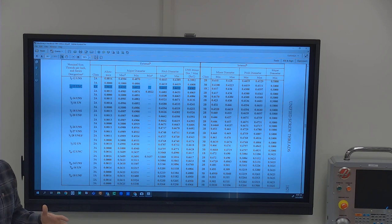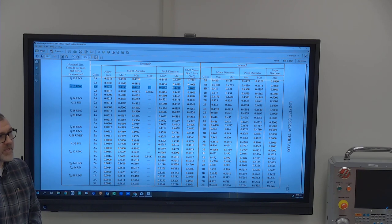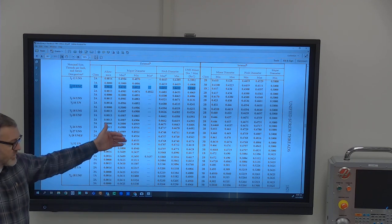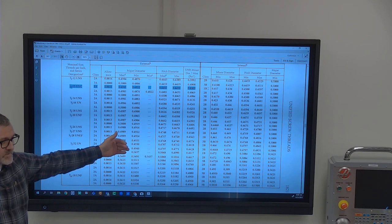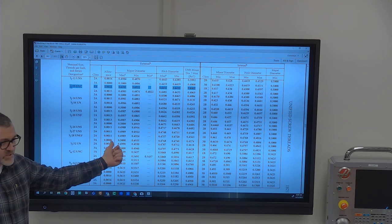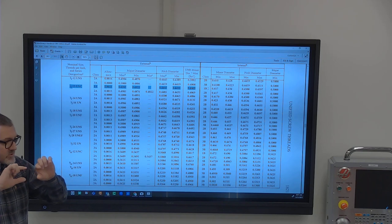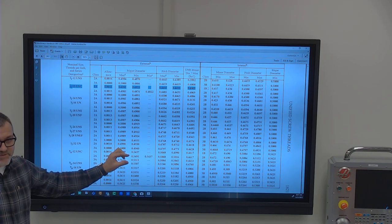We made ejection seat booster tubes to go in jet ejection seats, and we made probably 1,000 of them and never made a good one. They were like this long, 80 thousandths wall tubing, concentricity with like 2/10 of the whole length of it, 2/10 tolerance throughout the entire thing.